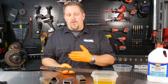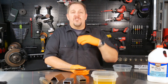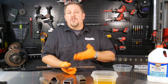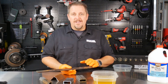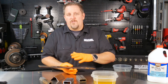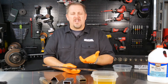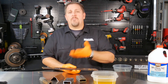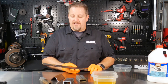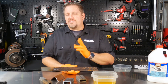So what is mill scale? I'm not going to get into scientific terms, but basically it's junk — all the impurities that float to the exterior of the steel during the molten process. So not only is it trash, but it's laid there during the molten process, so it's naturally binding to that steel. It's not going to let go easily. You're not going to be able to burn it off, you're not going to be able to just lightly sand it off. You've really got to get after it and either grind it off really hard, or there's another easier way to do this.